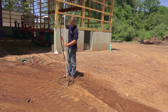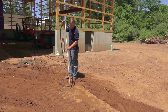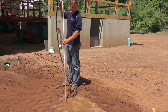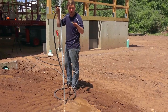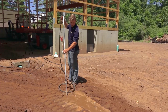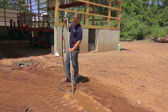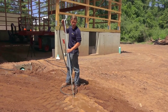In this area here, we are going to have a paver driveway, so we want to make sure we get that proper compaction. If we don't get it properly compacted, you're going to end up with settling, and you'll know exactly where this pipe was put — it will all be settled out. You see it a lot of times in walkways where they put conduits across or drainage. It's very common not to get the right compaction around pipes. Anytime you're doing a walkway, a patio, and you've got drainage, make sure you get proper compaction around that pipe.